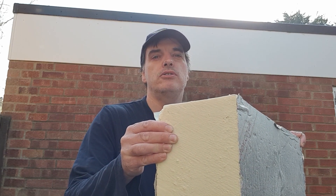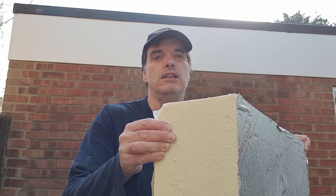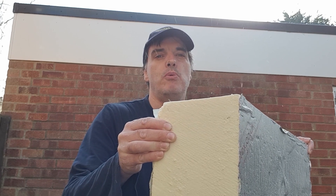You can get away with using 120mm if you don't want the height, but obviously you're not going to get the warmth. What we're going to go through is how we actually had to raise the roof height of the build and how we actually covered the insulation with the boarding.